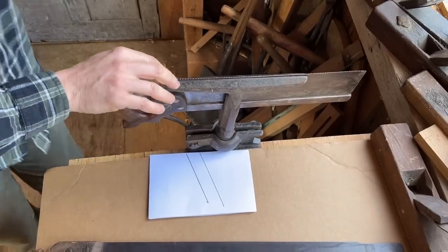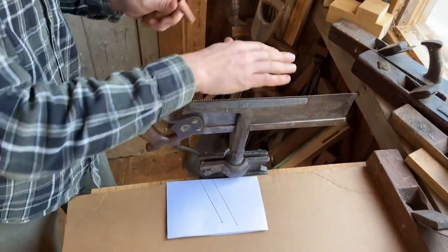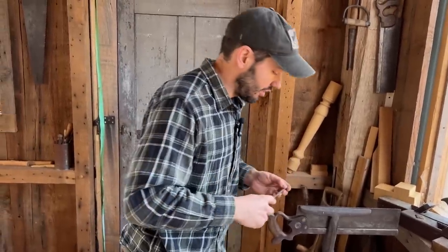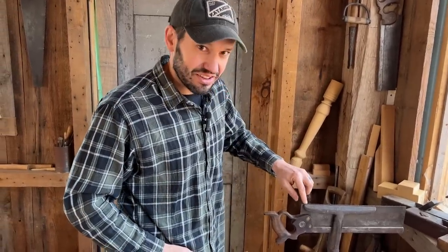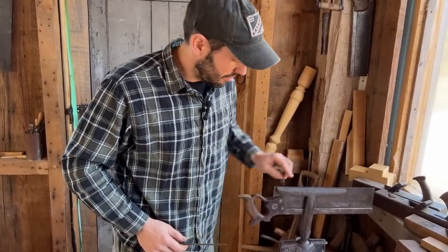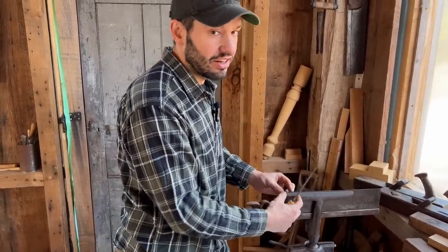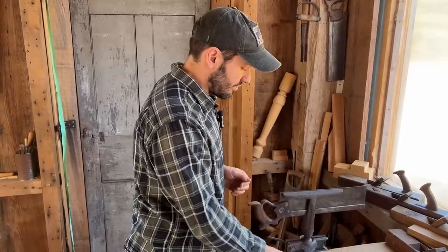And I actually love saw sharpening. It's really fun when you get into the groove. You get like a third of the way in, you're really moving along. I will say I start at the heel because my first strokes usually catch. I feel like I'm not into it, and I go like this, and it goes k-k-k-k. It doesn't matter as much with these teeth. You might beat them up a little bit. It matters more with these teeth because these are where you usually start a cut. So I would suggest starting back here under the handle. These teeth don't get used all that much. By the time you're up like an inch in, you're going to be going really smoothly, and you'll be in a groove. You'll have your angle down and everything else.